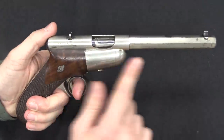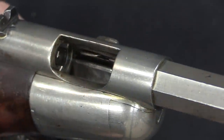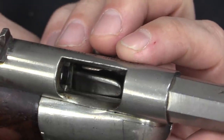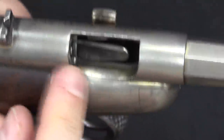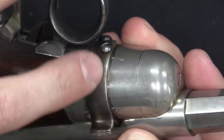So that's how this was supposed to operate. This is basically your cartridge stop, so that the top cartridge in the magazine doesn't fly out of the gun — it's held in place by that. And then if you want to unload without having to chamber every round, you can just pull on this, pull that tab back a little bit, and the rounds will fountain out of the magazine. That's basically a spring that's screwed onto the bottom of the magazine assembly.